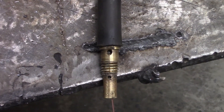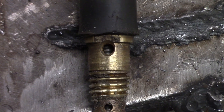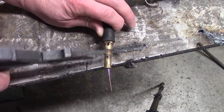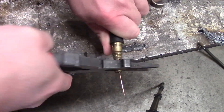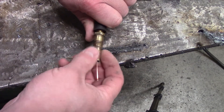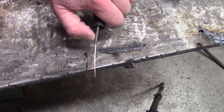Now we're going to look at that set screw. Can you see that twisted component down in there? That's the liner. Before you take the gas diffuser off, you need to take that set screw out, otherwise it's just going to twist the liner. Once the set screw is out, the diffuser — which shouldn't be locked on too tight, though people tend to do that anyway — will unscrew. There's the liner we were talking about. That's how you take the diffuser on and off.